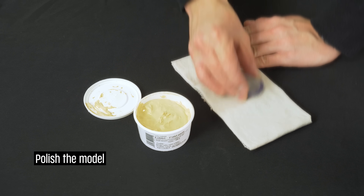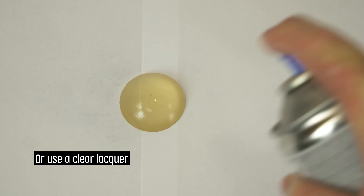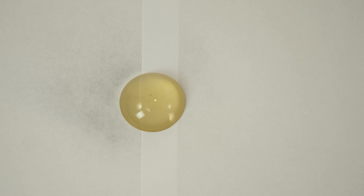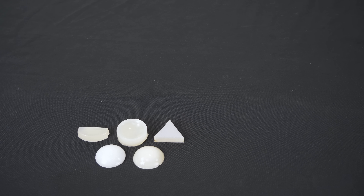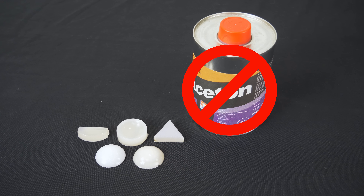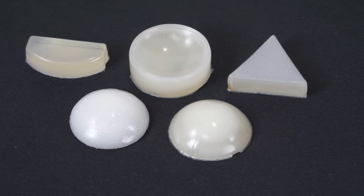When the sanding is done, it's time to polish the model with a piece of cloth and a polishing paste. If you don't have any polishing paste, you can also spray the surface with a clear coat, but keep in mind that a sprayed surface can be easily damaged. Some of you might say the post-processing takes too long and that smoothing ABS with acetone is a lot easier — well, not really. With acetone vapors you will get a nice and smooth surface, but the inside of the model will become foggy.